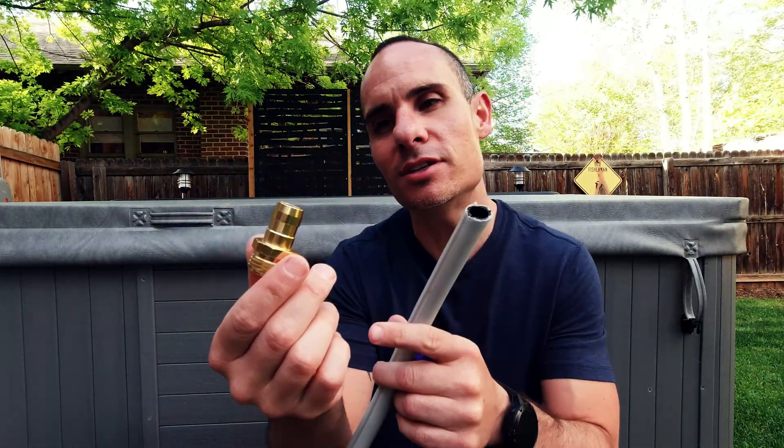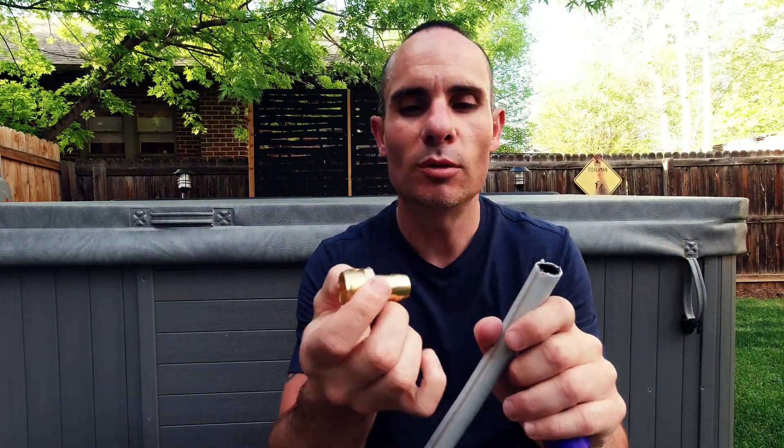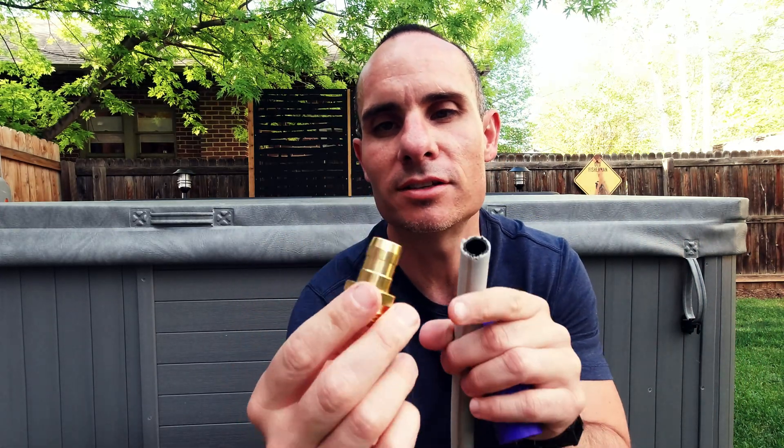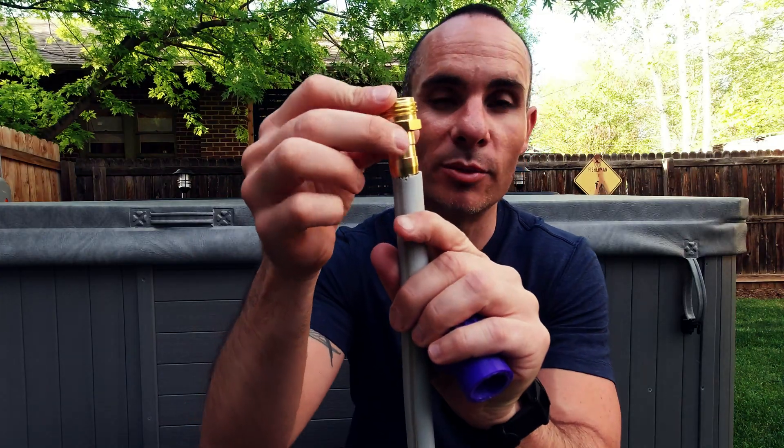A couple weeks ago I was putting some drip irrigation in my yard and I was using the garden hose for it. I had a high pressure nozzle on the tip and I was trying to go under a sidewalk. I eventually made it but in the process I ended up getting the hose stuck and I had to cut the end of it. So we're left with this — I can no longer attach any attachments to this hose and use it properly. Rather than go to the 3D printing community like I should have in the first place, I went to Amazon and picked up this brass adapter. It typically slides down inside the hose and gives you a brand new surface. The problem was it said it fits 5/8 inch hoses, which is what I had, but it's 5/8 inch outside diameter rather than inside diameter. So as you can see, it doesn't fit.